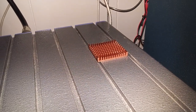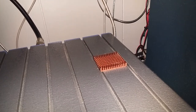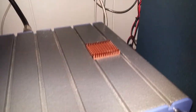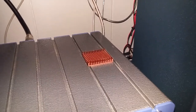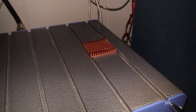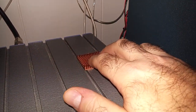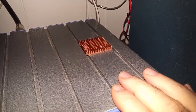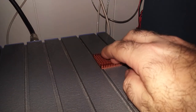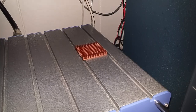What I did is I added a pretty old-school heat sink off of an abandoned computer and affixed it to the top of the unit with silver oxide heat sink compound, which when it dries becomes like an adhesive. This is good stuff and it conducts heat very well. The heat sink is right above the transmitter finals.